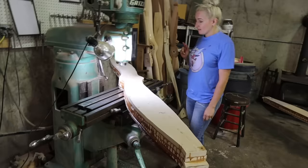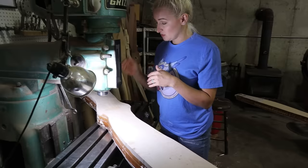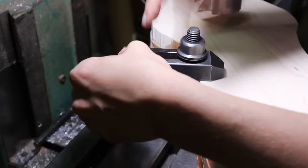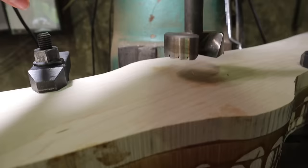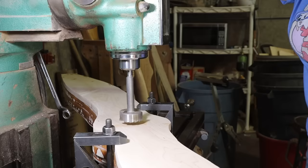This flat side is the side that goes to the engine. This is the side you're gonna bolt to your engine. So we are going to drill it this side up. And what I'm gonna do is I'm going to align the very, very tip of this with the holes that we drilled earlier. It's now time to drill out the bolt pattern so that the propeller can actually get bolted to the engine itself.